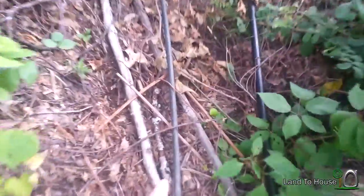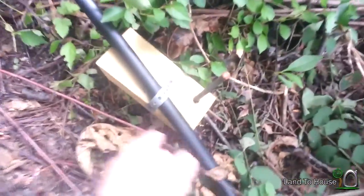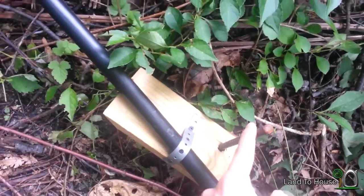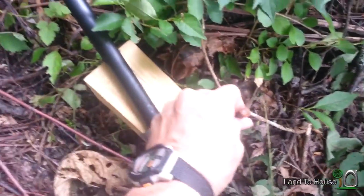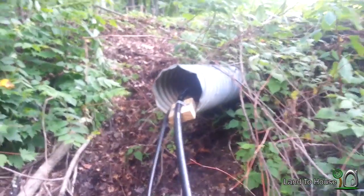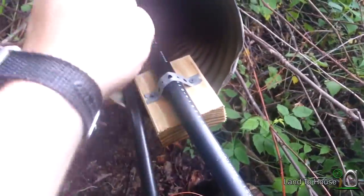The delivery pipe goes along next to the drive pipe. Now I've got a block of wood with a rebar attached here. You can see the hose is jumping, so this keeps it stationary. Because inside of this culvert pipe we're actually getting the hose cut in half because it was jumping inside this pipe.